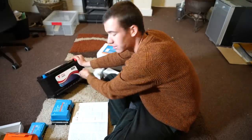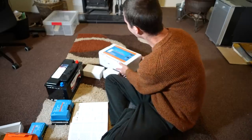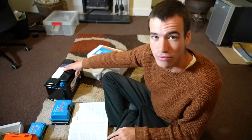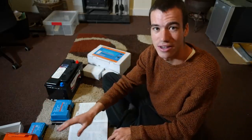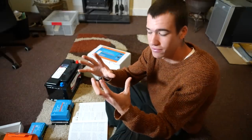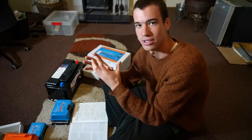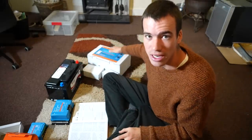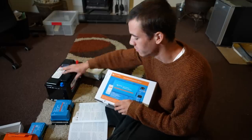How do you actually make use of the power from this battery? It's got no three-pin plug sockets or USB ports. Well, I just learned about inverters — I've got one here. My computer runs on mains power, which is 240 volts, but the battery is 12 volts. You can't run that straight off a 12-volt battery, so you need an inverter to convert 12 volts into 240 or 230 volts. This connects to the battery and lets you run normal household appliances.